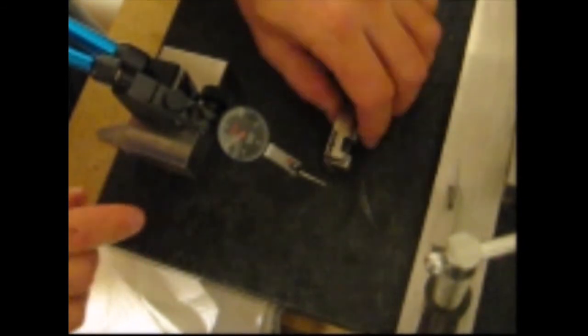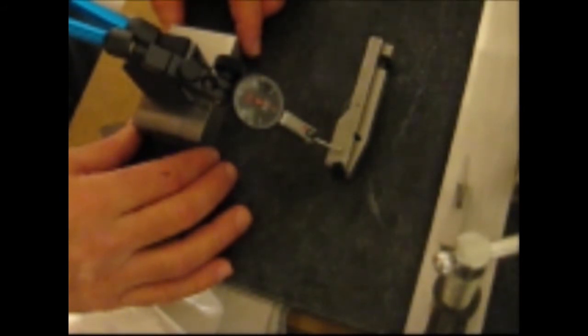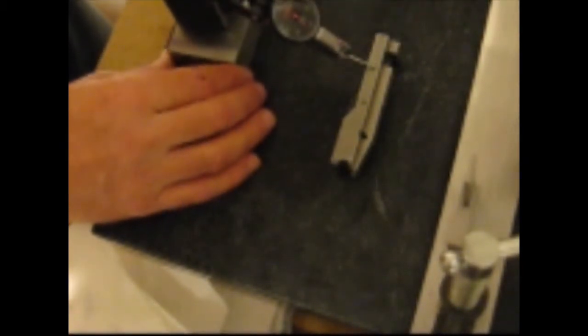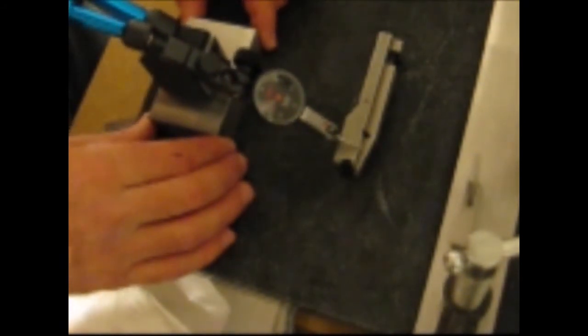We'll go back to the enter point — right back to the 15. That's your repeatability. Let's go off and flip it over. The bolt isn't perfectly precise; it does rock just a little bit, but not much. It's been pretty accurate. Let's enter here — you can see it goes right about to the 6 o'clock position again, 5 ten-thousandths off the dead 6 o'clock position. We'll sweep the bolt. We're getting a little bit of an increase, and now it's going back down — back to exactly the 6 o'clock position. It seems we have a high spot right here behind the charging handle, but I would say that's pretty darn precise. Back on we go, and you can see I have my repeatability to 5 ten-thousandths of an inch — half of one thousandth. It's pretty good.